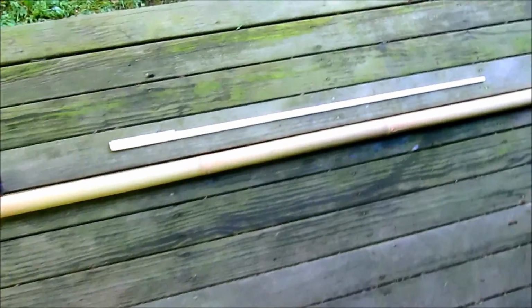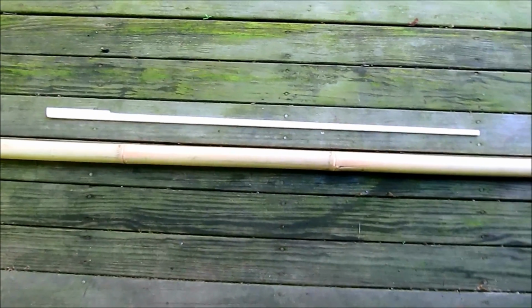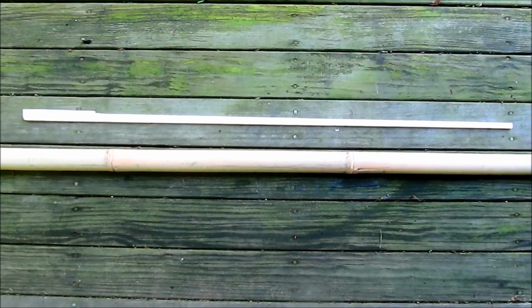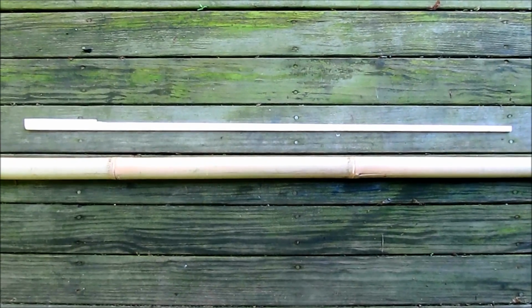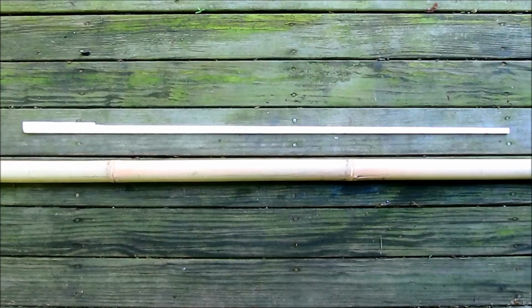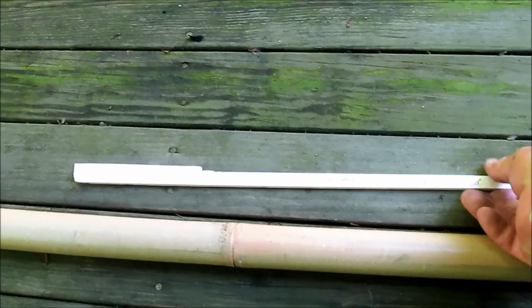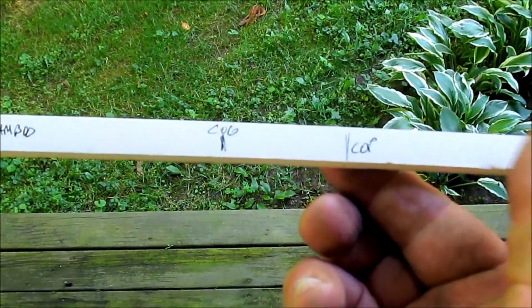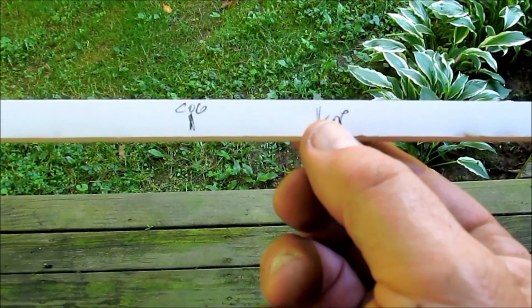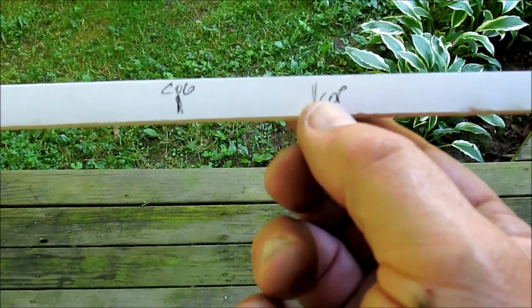That balances, the center of gravity of that assembly is up from the bottom 66 inches. Now I've made a 1/3 scale foam board cutout of this with which to determine the center of pressure. That is the center of pressure, where this balances, up about 21.5 inches, which is 60, I think it was 20.5 inches.